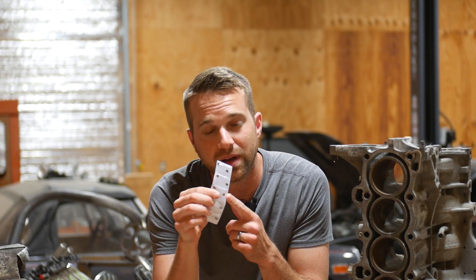There's steady state tuning and then transient tuning, which is a power run, which you probably typically see. What I'm trying to do is replicate the exact same information I'd get from a dyno session on the road. In a past video, I put a strain gauge on the CRX's front control arm to pick up the load that the engine was creating as I accelerated. The strain gauge data has been working great, but right now it's being plotted versus time — it's not replicating the data that a dyno would put out, which is that table of engine RPM versus power, so I can look at engine load versus timing to dial in that ignition table.